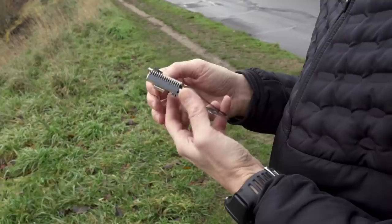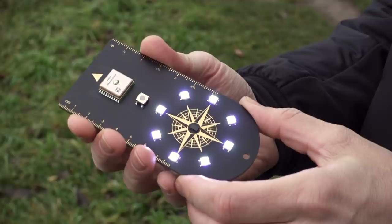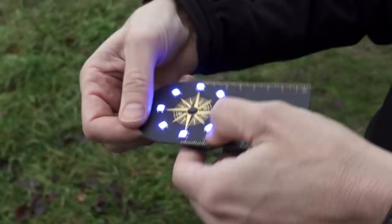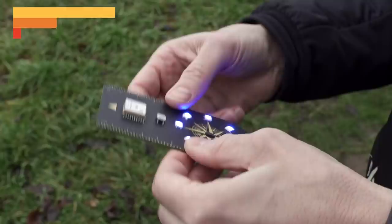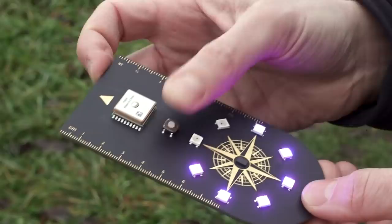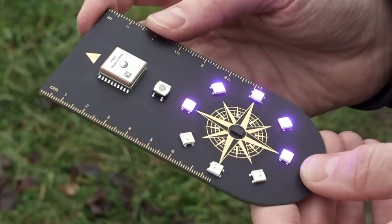It's been three weeks since I started the design, and today is the final test. Let's go find some pizza. Let's power this thing up — plug it in. First thing we're going to see is the LEDs initializing so we can make sure they work. Now we're waiting for the connection to the Particle network. The green is looking for a GPS fix. Now we're in the next state — the compass is ready for calibration. I'm going to hold the button down and all the lights will turn on. Now we're in calibration mode — we need to rotate the board in all of the different axes for the magnetometer to read all of the different values, in X, Y, and Z. Push the button to exit calibration — now we're in our rainbow color wheel, waiting for us to push the button to start our quest to the pizza place. Sending the coordinates. Waiting for a response. And now pointing to pizza.